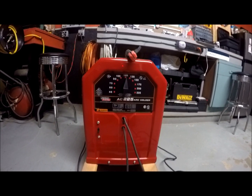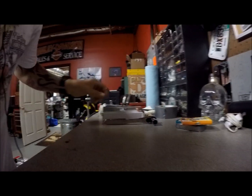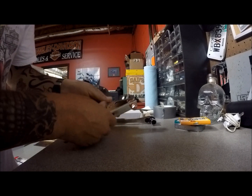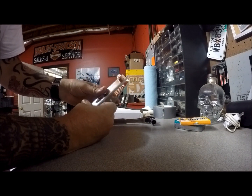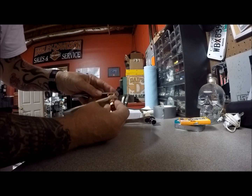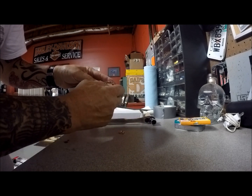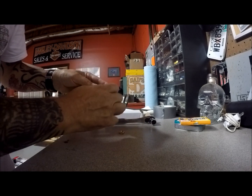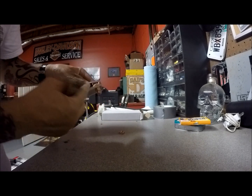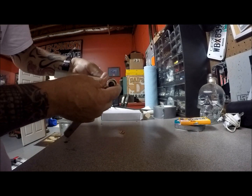But also, the directions told me that. So, that's how I know. See, it doesn't always hurt to look at the directions. Okay, so there is my work clamp. And I can see right here that this is where my clamp is going to go. I have two nuts on this stud right here. One is a locking nut. So that one's going to take this whole clamp mechanism and secure it into place. I'm going to make sure that that's tight.